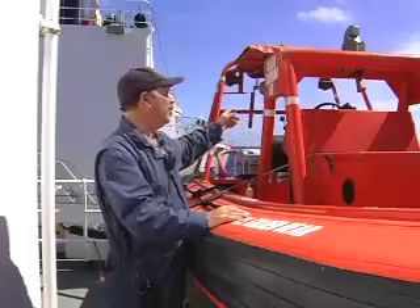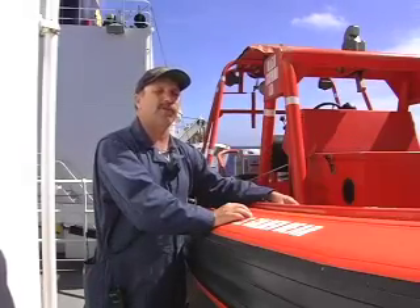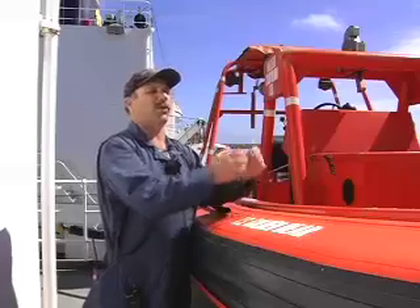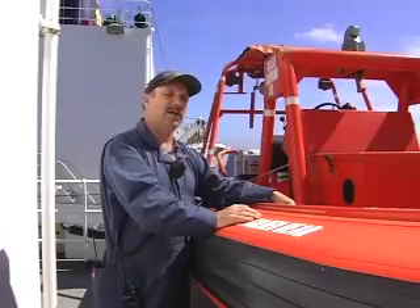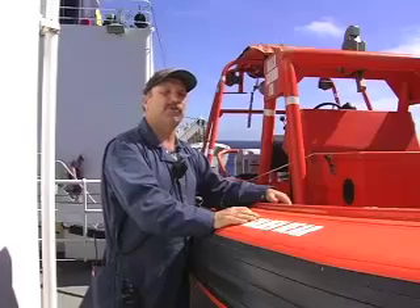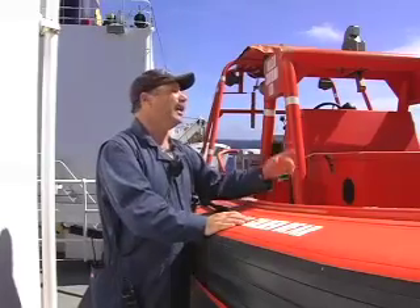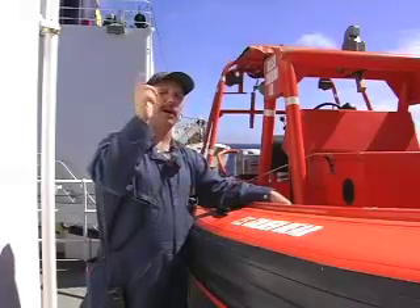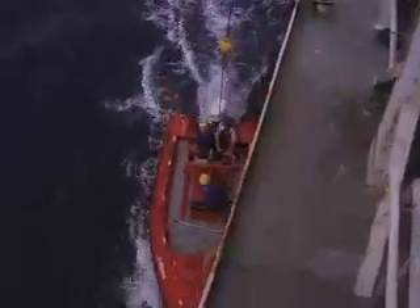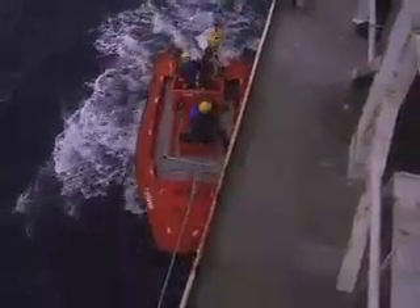You want to make sure the headache ball — the weighted ball with the hook — isn't too far off the water. Otherwise, when they hook it up and drop into a swell, it could lift the vessel out of the water and knock personnel out of the boat. The headache ball should be within about three feet of the surface when they reconnect. Once reconnected, they immediately whip up with the crane. The boat operator signals the cadet in charge on deck, who gives hand signals to the crane operator, and they raise the boat up to the embarkation deck.